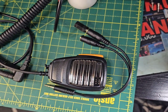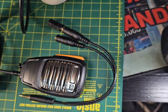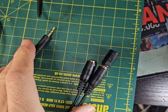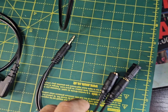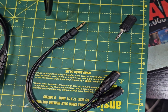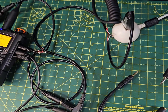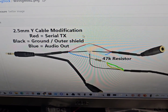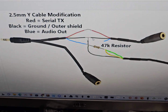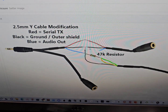When it comes to PTT, to do this properly — as shown in the diagram on my PC — you're going to need a twin pin microphone, two Y adapters (one 3.5mm at one end and one 2.5mm at the other), and a 47K ohm resistor. Look at the diagram on Nick's website — he's got a full diagram that includes the microphone as well. Thanks for watching. 73.